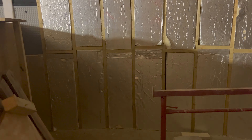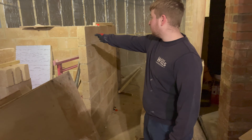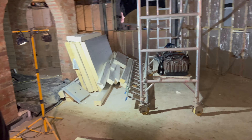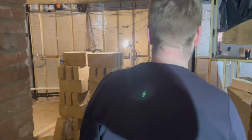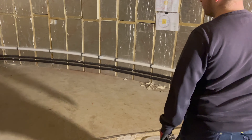We've split all the circuits - front lights, back lights, and sockets. We've wired ring mains because we favour them over radials, and that's how we're doing it on each floor. It's a three-storey house. This area's like a little office/workstation, then there's a storage area, a utility/linen room, a bar with a toilet, and then this is the gym slash cinema theatre room. The board's going here, so we've brought all the cables - the router and data - to this point.